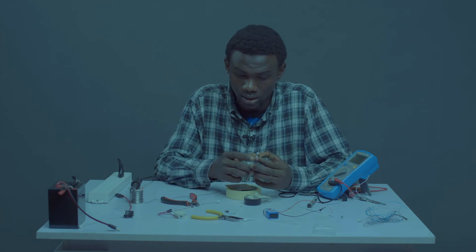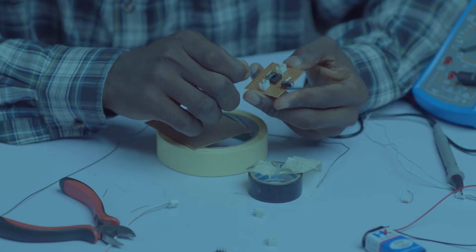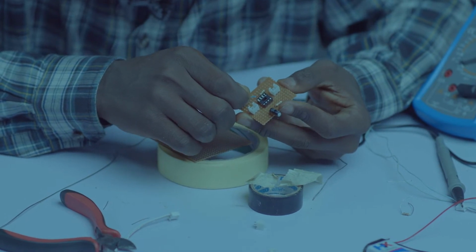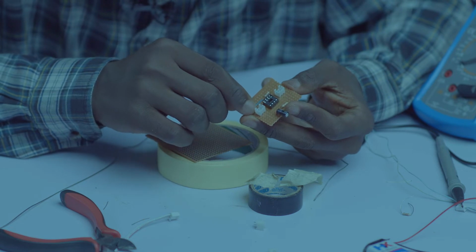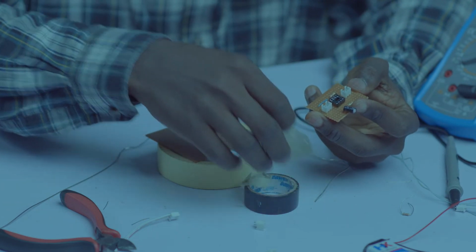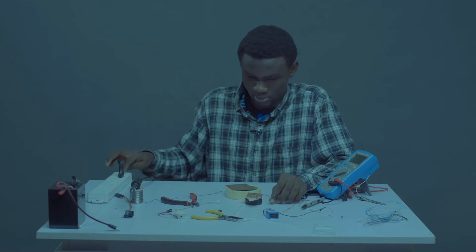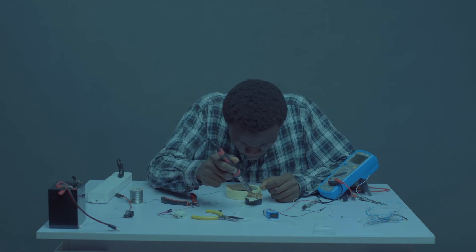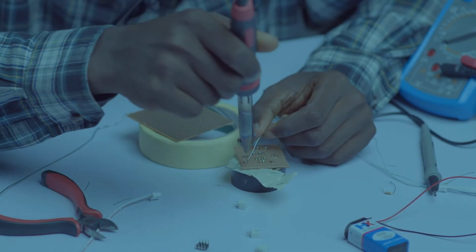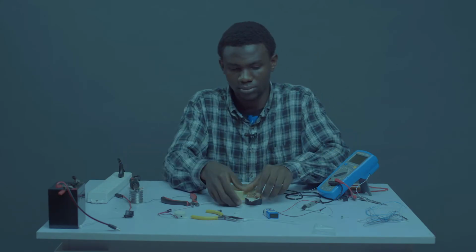Okay, we're fine. Introduce our jumper. On pin 3, which is the third leg on the IC pin, count 2 holes first, second. On the second one, drop the jumper. Then let's move to the other side. Let's drop the jumper too. Okay. We have done that.